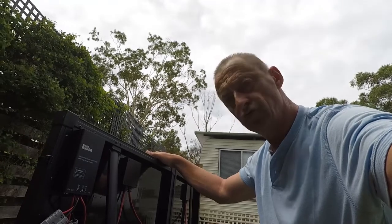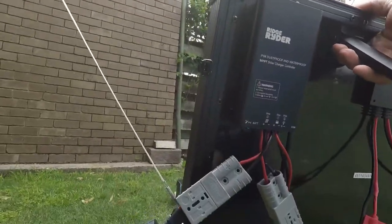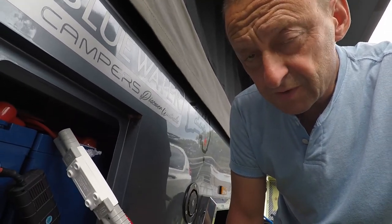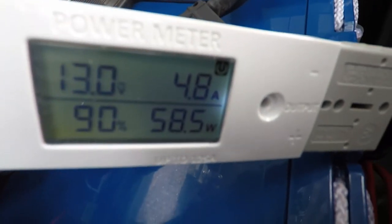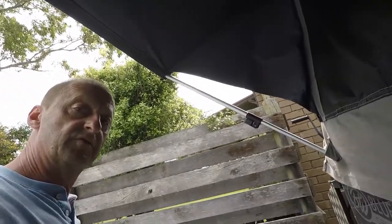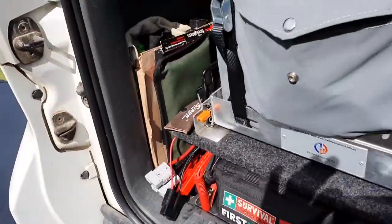Just tried the MPPT controller on the cable and there she is — we have two green lights, one flashing green. We'll connect it up. We've got two lead crystal batteries in here which are performing really well; I've only just replaced them because the other two died on me. Pure Energy, I think, is the make — highly recommend. As you can see, the more the sun comes out it's still going up: 5.3, 5.5, 6.3 — yes, I am quite impressed to be honest. A 160-watt panel for $279. There they are, the old Ridge Riders, all set up and we're in the sun.